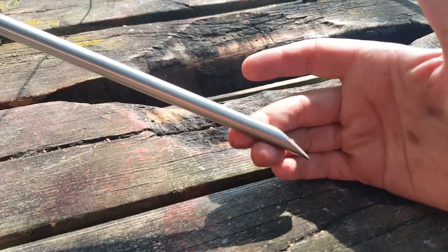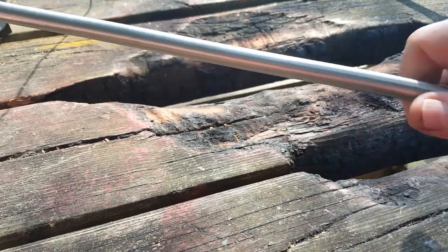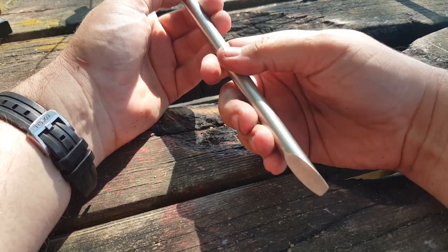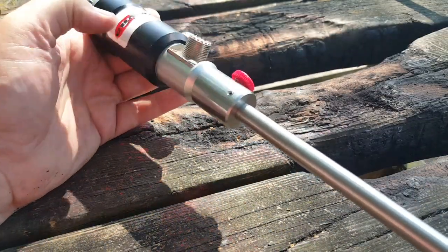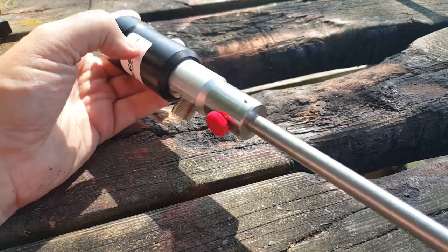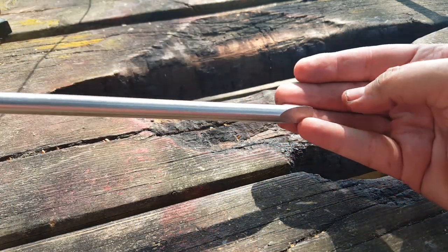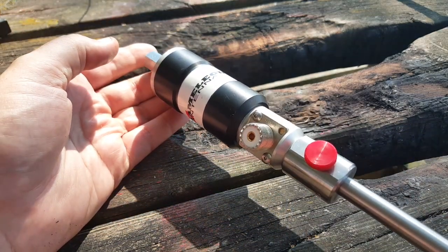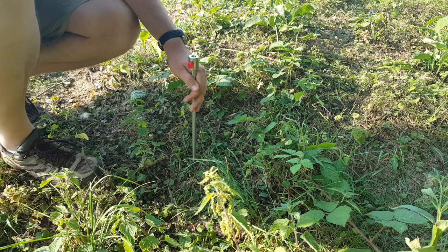It's awesome — I was hoping for one and I got one, and that's perfect. One advantage of having a spike like this is that your antenna is connected to ground, because of course this is in the ground. It will act a bit like a counterpoise. Earth is about 300 ohms resistance, so stick this in the ground and I think it should provide very good results.